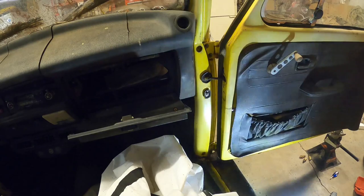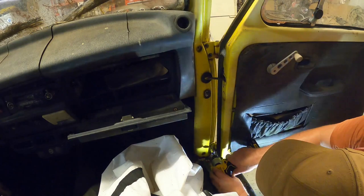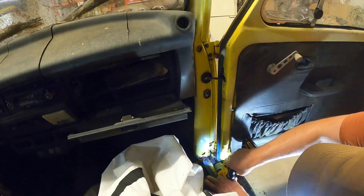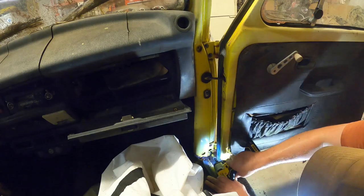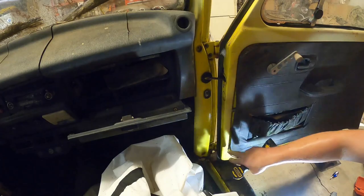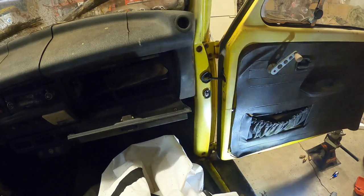What I'm doing with this is trying to get them to loosen up — going loosening, tightening, loosening, tightening back and forth, hopefully to break that rust that's down in there. Let's try the impact driver again. Got it! With these screws, they seem to be pretty tight in there so just be careful you don't want to strip them. That manual impact driver doesn't seem like it's doing much, but as you saw, I couldn't even move them with my little impact driver — after hitting them a few times it just broke the rust up enough to get them out.